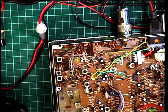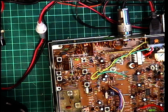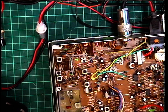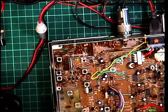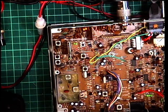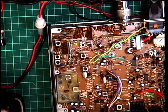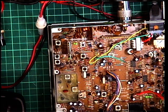Now, as I've said a million times before, this is into a commercial test set which reads watts on the frequency we're looking at, not just a broad amount of RF. If you get a cheap meter, it's not going to know that you're on 27-point-whatever megs, whereas this does. So if you plug this into a cheap SWR meter that costs a tenner, you'll probably find it's doing 6 watts. It's actually doing 3.7–3.8. Now, there may be a power regulator — I'll get back to you on that if that's the case.